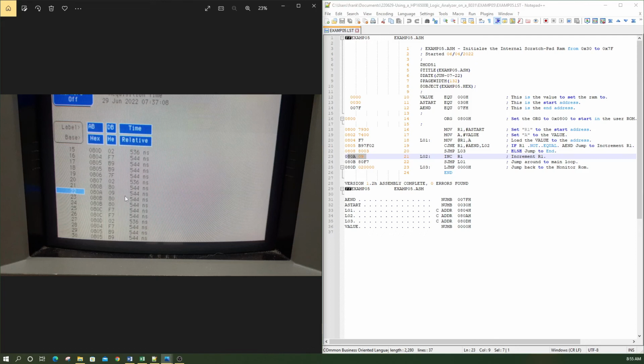So to get the timing, the number of cycles right, sometimes it has to double up on the address and data. So this is the address bus here, the data bus, and this is the time for each pulse of that clock. So two of these is considered a cycle. Sometimes it has to double up to make up for the difference, and sometimes you see the prefetch. So this kind of shows you the inner workings of that processor. This is important sometimes if you have to troubleshoot a computer. Kind of your last resort is to get out the logic analyzer and go through the hardware and architecture of that processor to see if it makes sense. So that may help you to troubleshoot the issue.